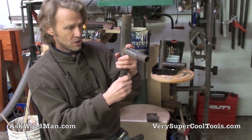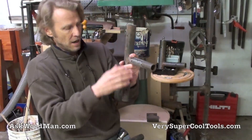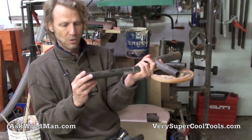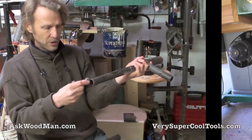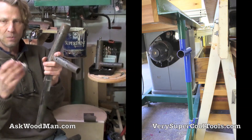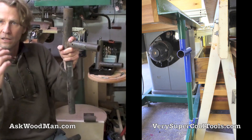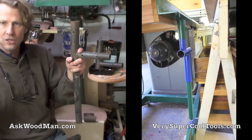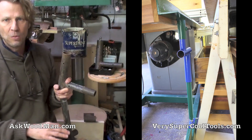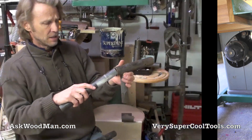This was welded to the bottom of the angle iron, and I did not even cut it off until I got over to Jerome's, with the nut on it, so I had extra length. I had about two inches of adjustment for final height, so I could articulate it and change the height and just dial it in until we had it just perfect for it to sit right on that mobile base that I welded up.